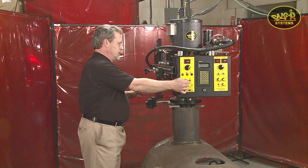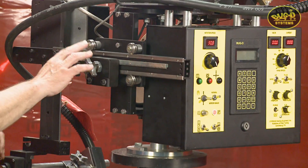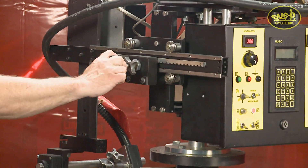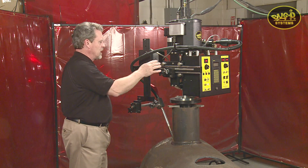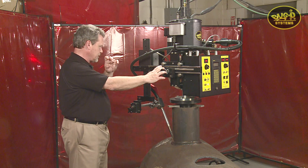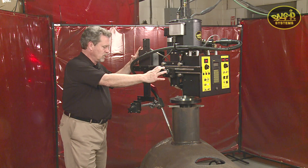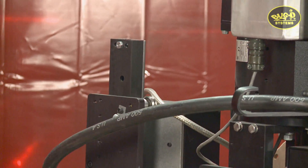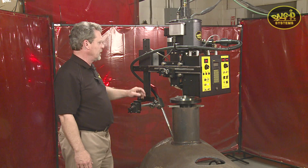The torch support is a hardened-ways racking system. Horizontal adjustment in and out is manual. Vertical can be preset and also used for multiple pass repositioning of the torch each pass. The vertical is motorized with encoder position, working with the program to create the rise and fall required depending on the type of application.